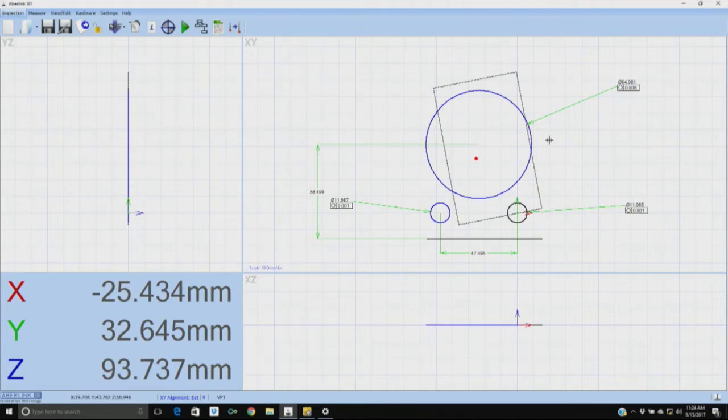The market target given this very peculiar form factor — a rotational stage with an arm that slides back and forth — is notable because there are portable CMMs out there, but they're all manual. This is DCC. Parts are getting smaller, so with this Radius Z machine we can put parts all the way around it. You could batch half a dozen or up to 16 parts under one program, or have multiple different parts in different quadrants and measure those.